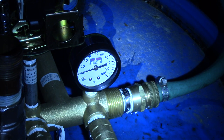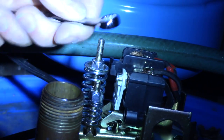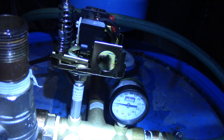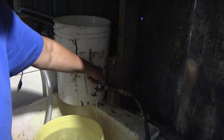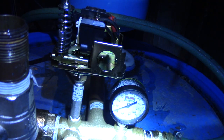I know it's hard to see, but the pressure is rising. My pump is not powerful enough for the factory preset, so I change the cut-off pressure. Now the pump stops just before the twenty-pound mark. And if I open the tap, a couple of seconds later the switch closes and the pump starts pumping.